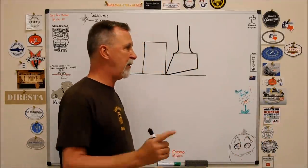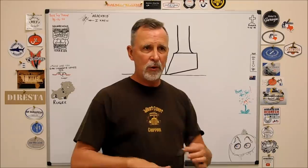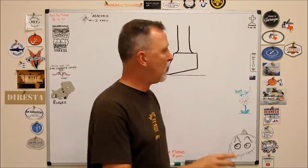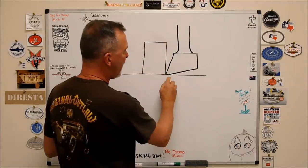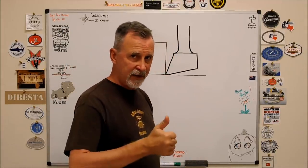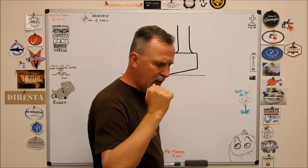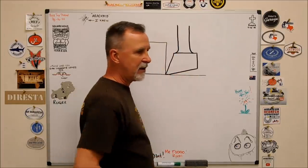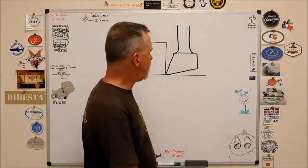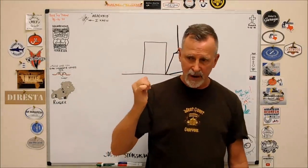Those are two. One of the things you want to consider when you backbore is if you have a positive cylindrical feature on any type of part, try to remove as much of the material surrounding that as you can. And when you grind your tool, make sure that whatever land you have on your tool is sufficient to clean up the surface around that positive projection, but you don't want it completely flat because you want a nice small bite as you're coming down with the boring head. And when the bottom hits, this big surface contact takes over, and it's going to give you just a rah. It's going to ruin your day, probably ruin the part. So little land, back relief, do your turning, and just be gentle, creep up on that bottom flat surface.